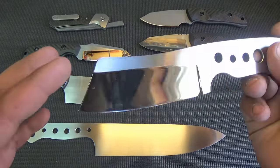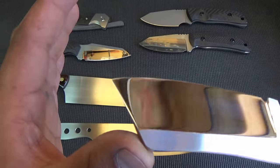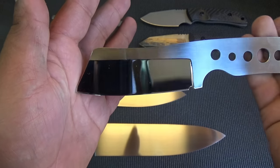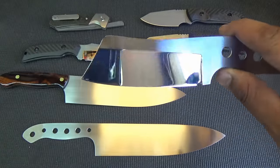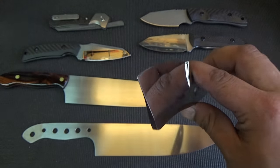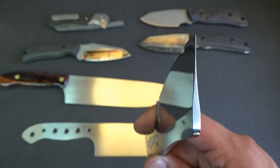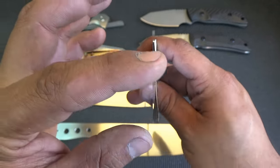And we have one of the cleavers. Now I know you guys look at this — it's got that same super, super high gloss grind with satin flats, and it's got a little bit of haze on it right now because it's got an oil on it. And I know some of you guys see this and you're like, dude, that's not a cleaver. You're right — I don't know why I call it the cleaver. I guess maybe because it doesn't have a pointy tip. This was actually modeled after a straight razor when I designed it. I love the look of a nice classic straight razor and I wanted to make it into some kind of knife. For you guys that like to grind thin — looking at it from this angle, you can see why I like that straight razor look. That super lean, hollow grind — this is very, very thin. This is going to be an excellent slicer when it's complete.